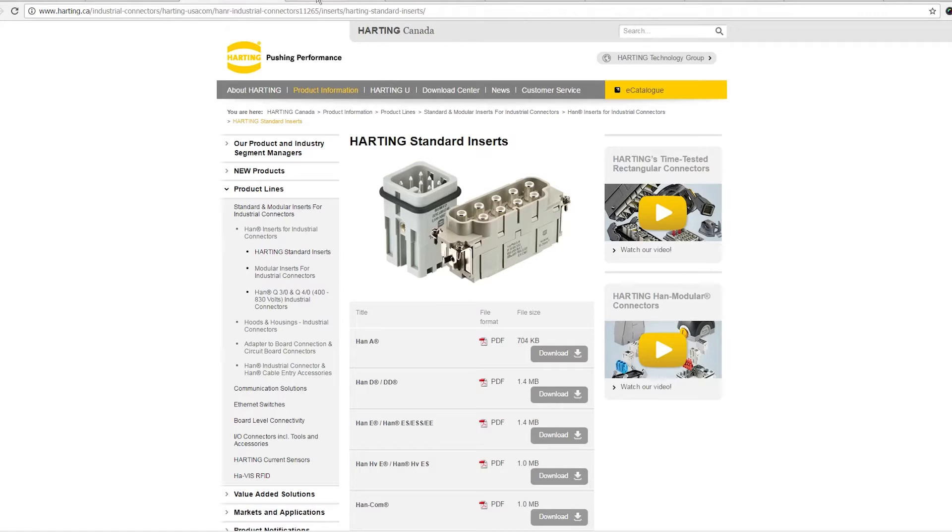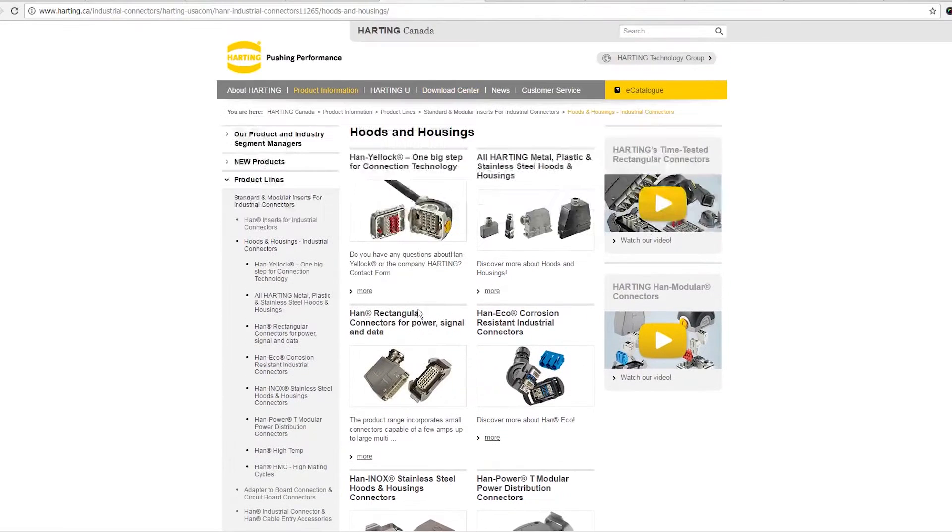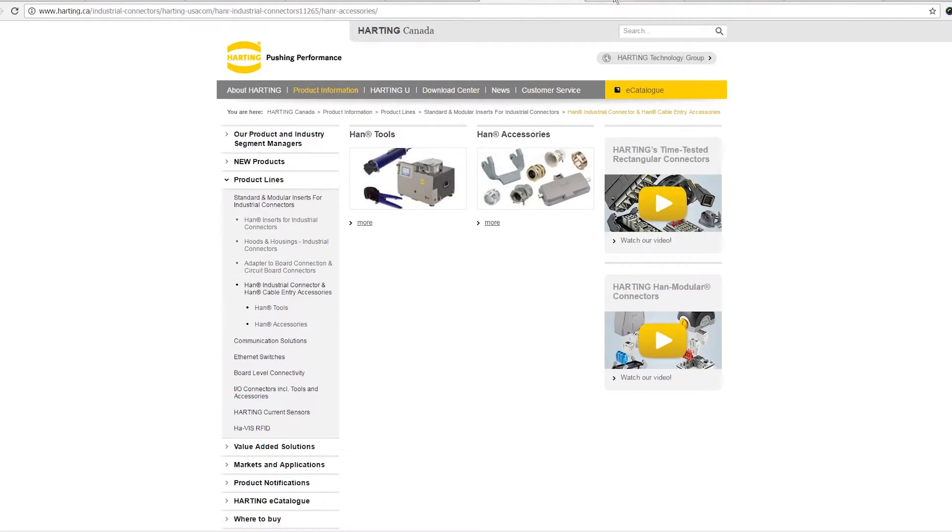There are lots of varieties. The bottom line is there's an overwhelming number of part numbers and options. If that wasn't enough, and you have a very specialized application, they have modular connectors where you can have things like fiber optic or pneumatics. You can have registration pins to make sure you can't misconnect connections. You can have network and RF coax shielded connections. There's literally no end to what they provide — at a cost. So if you're assembling a train, airplane, or aerospace product, these are going to be one of the first things you go to. But it's a little hard to get into — they cost a lot, and the crimpers are expensive.